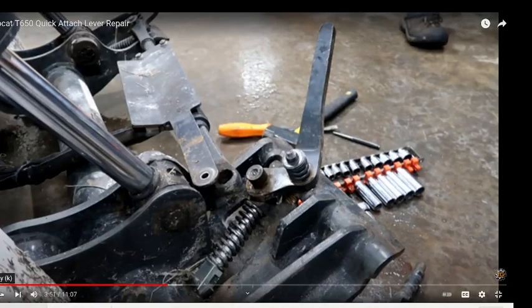Anyway, that's useful. The weakness of these quick connect mechanisms, for heavy things, is the way it works: it's a 1-inch pin that goes down into, for example, a bucket, just the tip of it going in. That's not going to hold if you've got a super heavy implement, because it's just a 1-inch pin going into a hole. It can come loose or come off if your implement bends at all, because it's only going in an inch into a hole. Sounds strange.